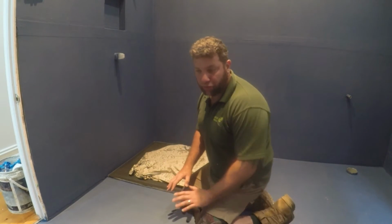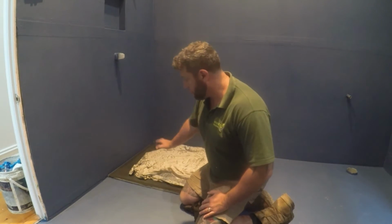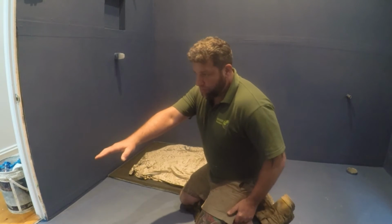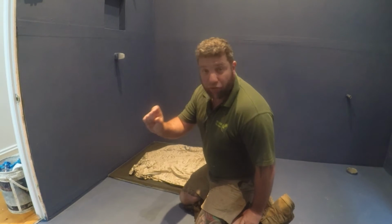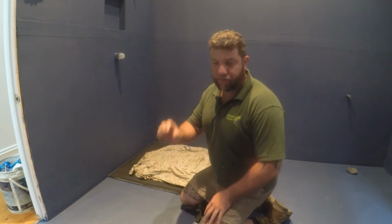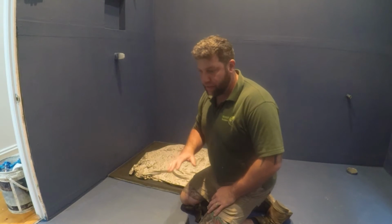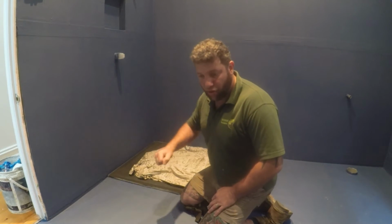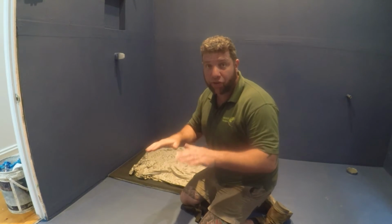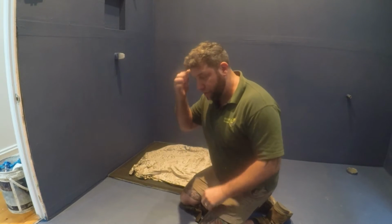We've made all of the floor, we've had to rebuild the entire subfloor, and we've made sure that it's all been falling over into this direction. We've also got a bit of a lip at the door, which is about 12 mil, and the tiles are 10 mil. So that gives us 2 mil of glue straight underneath as a really good base. We're using a 10 mil gauge the whole way around so that we've got an actual nice thick gauge to embed those tiles in. We don't want any air. If we have air, then the tiles can move and they can crack.